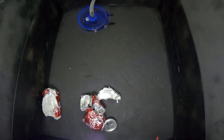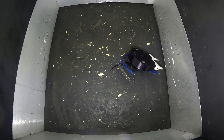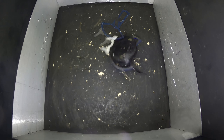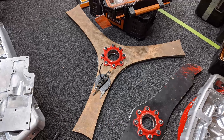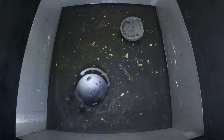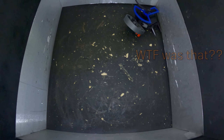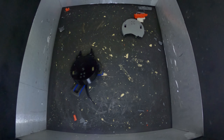This brings us to the redesigned righting arm. I thought I'd cracked the code on this weeks ago, but it turns out I was sorely mistaken. Take a look at some of these tests. With the last righting arm, I did about 5 tests with the long arm and 4 of them were successful, and then with the axe head weapon, I did 5 tests in a row, of which 4 were successful at first. But then once I brought the bot in my backpack — with the self-righting arm crushed in my bag — to where Bloodsport was being worked on and brought it back, I tried to test it a bunch of times in a row and it failed every single time. The flex my backpack forced on it made it overall a lot more pliable, causing it to fold under the robot instead of propping it up to self-right.